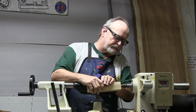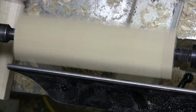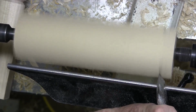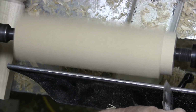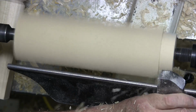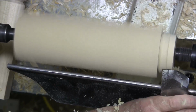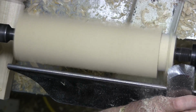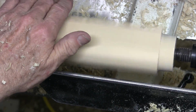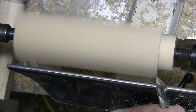So here's the pommel cut. 2 flavors, or the common ones. A square-shouldered. So let's say it's going to be right in here. This is a square-shouldered. I always begin all of them with a square-shouldered pommel. Plane up to it. Should be it. There we go. There's a square-shouldered pommel. Could go just a tiny bit deeper here, it looks like. Just a little deeper.